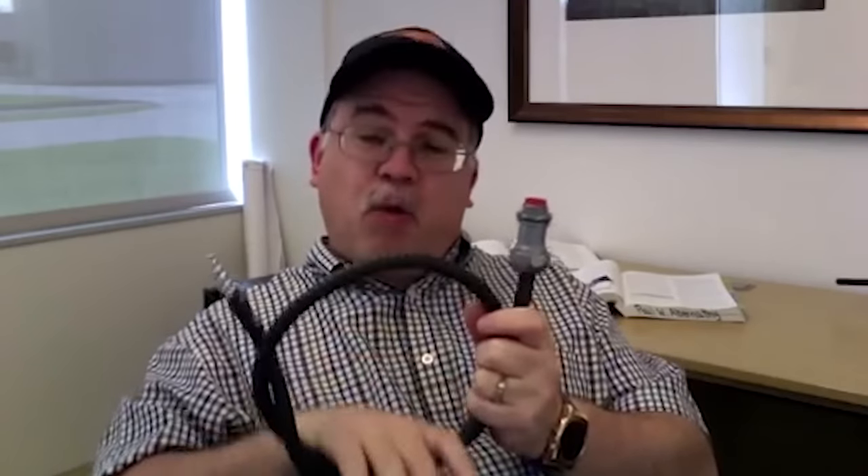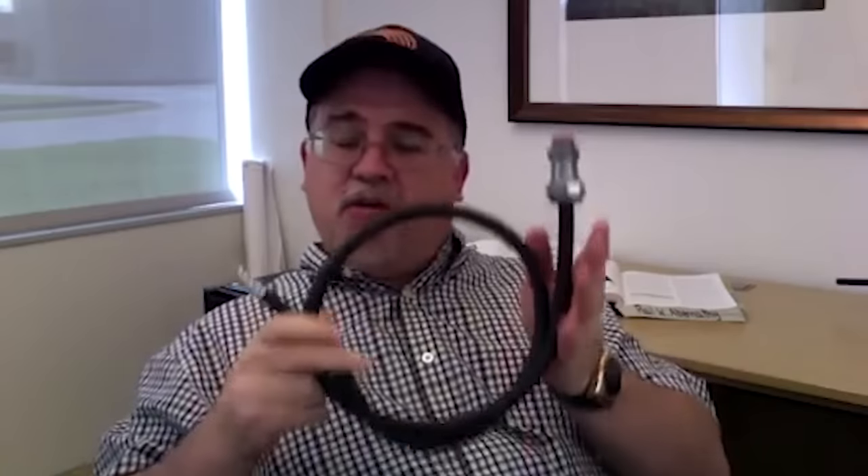If you're using this product in a wet location but the terminations end up in a dry location, you can use a standard fitting for the termination since it's not being subjected to a wet location — the cable itself might be running through a wet location, but that's acceptable because it's rated and identified for a wet location. If the termination is in a wet location, you have to have the wet-rated fitting. PVC jacketed MC can also be used on parking decks and is rated for direct burial — it'll be marked right on the side.